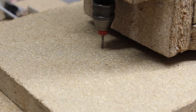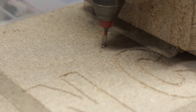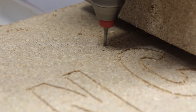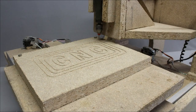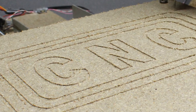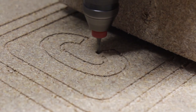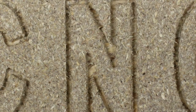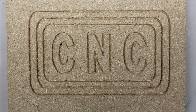Wood can also be engraved — here 20mm chipboard as used for the machine frame is being engraved. The mechanism isn't ideally planar and the drive doesn't move perfectly parallel to the base plate, so the router dives into the material with varying depth when moving along a path. You must look closely at the plate to notice that error. Lowering the router for a second run, with all other parameters unchanged, makes the paths clearly visible. The cutting edge isn't perfectly smooth, so you can't engrave tiny structures — the characters shown are approximately 5cm high.